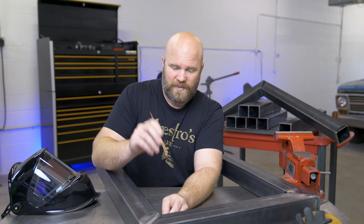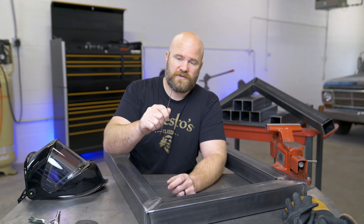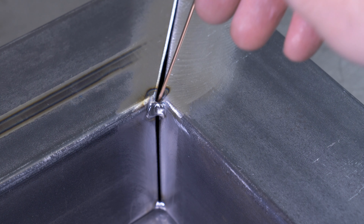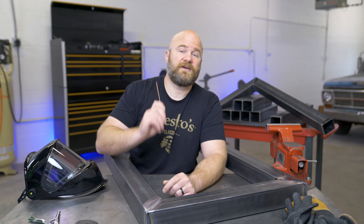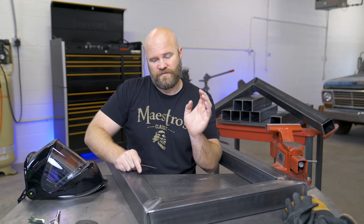So in this video, I'm going to show you how I personally will weld this gap up and the techniques I would use. I have a piece of Blue Demon 1/16th (1.6 millimeter) ER70S-2 TIG rod right here, and as you can see on the side gap, it easily fits down in the gap, and on the front there are a couple spots it'll go through too. I don't know if this technique works on any gap, but it definitely works well on thin sheet metal and thin tubing like we have here.